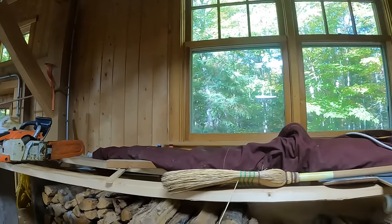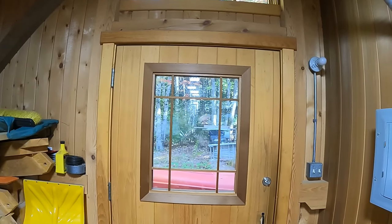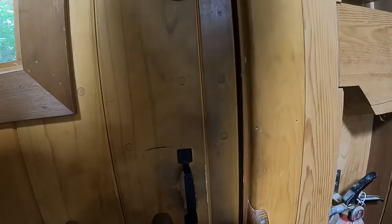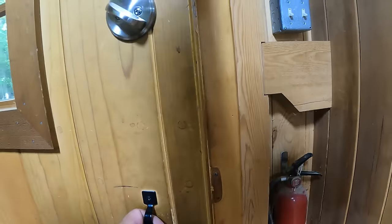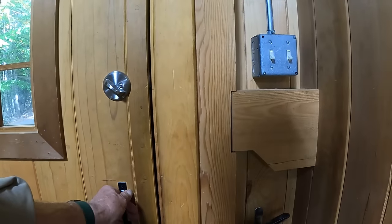And this shop is heated by wood. Oh yeah, that's John. Cedar door, hemlock frame. Nice. Listen to that, ladies and gentlemen. So among the things that I've heard about and never been up close to that are part of John's program here is this wood-fired gasification boiler to heat the zones with radiant heat in the concrete floor I'm standing on. And in the upstairs, he's got some radiators that also use it.